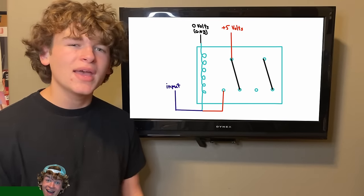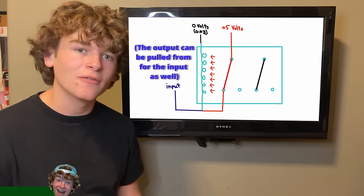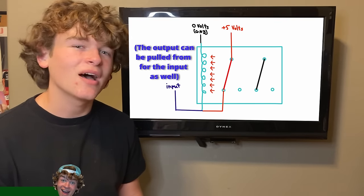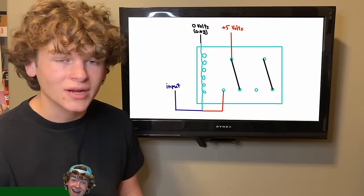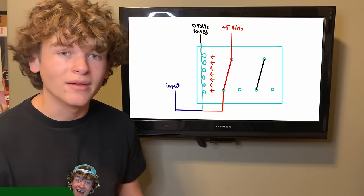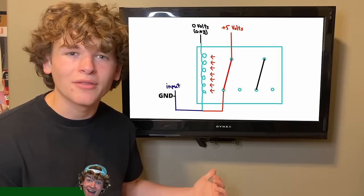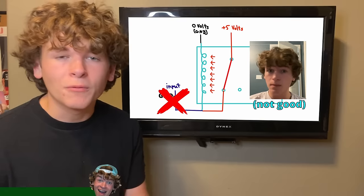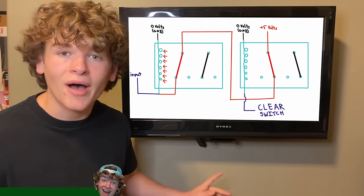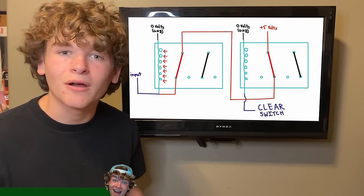Here's how it works: if you design a circuit around a relay like this and provide voltage to the electromagnet, the relay is able to power itself through its own switch, meaning it stays on even after the button stops being pressed — the relay remembered that it was turned on. But eventually we need to turn it off, and you can't just apply ground to the other side of the electromagnet because that creates a short and can blow up the power supply. What we need to do is cut the positive voltage feeding into the relay with another relay, and that's how we clear all the inputs.